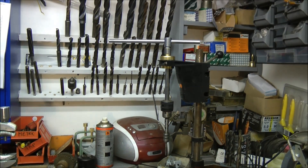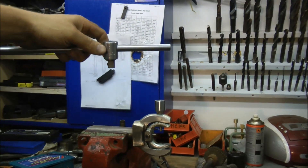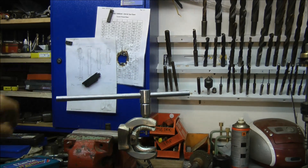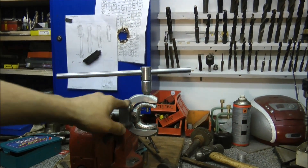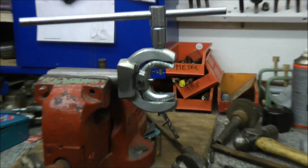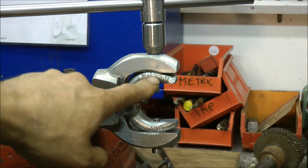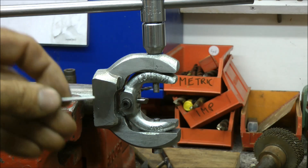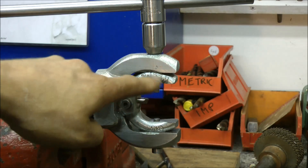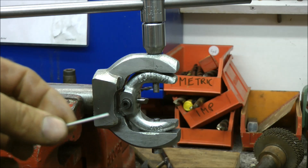Whoa, that was hard work. I need to pinch that now — so you pinch that, and that will now go on there. Oh yes, everything's fine. A lovely fit — I couldn't get a better fit if I tried. The advantage of that is when I finish with the tool I can take the handle away, and it's easy to store and doesn't take up much room. Let's have a closer look. Jobs to do here are to clean these bits of shaft off top and bottom, and I need to put a pin. I'm going to use one of these rivets because these are hardened steel pins — drill a hole and pin through there, and that will locate the whole thing together. So when I turn that, this should turn as well. I'll get on with that and have a go on the lathe. I think they're about 1.5mm, so that's fine.